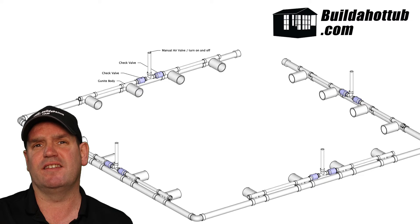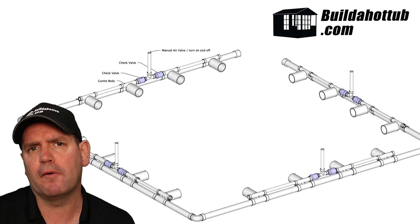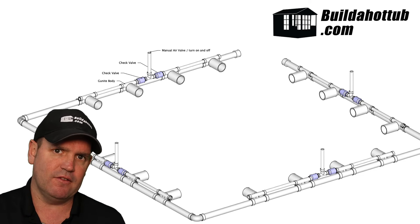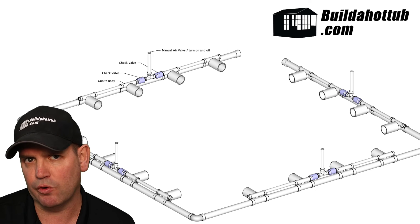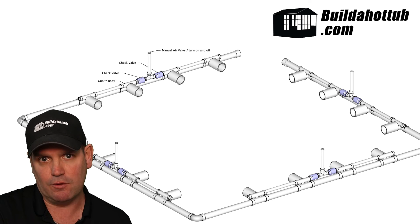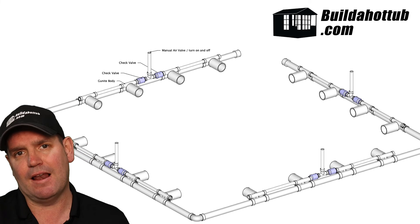As shown in the diagram, instead of connecting everything together — this is just an example with four jets — you've got that vertical one and a half inch air pipe with an open or close valve on the surface of your tub. Now you've got to bear in mind that when you turn off the pump, water is going to flow into those air lines. So you've got to make sure that the valve you're going to open and close is above your water line. It's exactly the same as with a blower system where we normally put in a Hartford loop. For this venturi setup, we just make sure those venturi lines go above the water line, then we can rely on gravity to keep the water in the hot tub and below those valves.